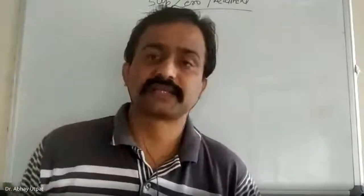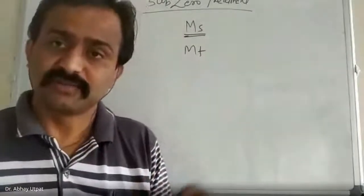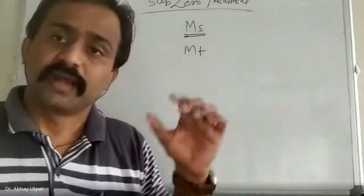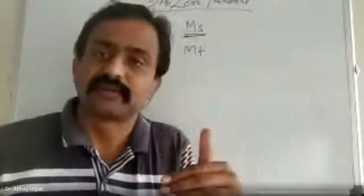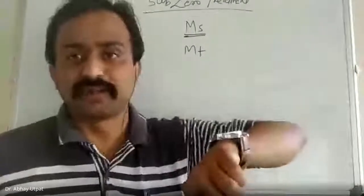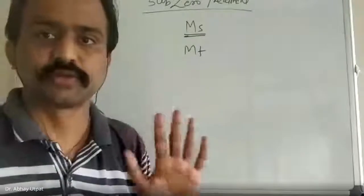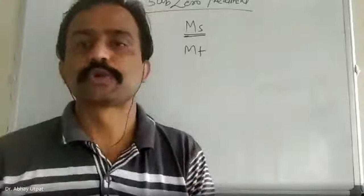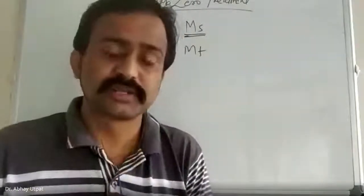And a question may be asked in the exam for 2-3 marks or 3 or 4 marks. For such components, usually alloy steels, the MF temperature is minus 10, minus 20, below 0 degree Celsius. That's why that hardening treatment is called sub-zero treatment. Very simple. I hope you understood. Sub-zero treatment is nothing but quenching below 0 degree Celsius. Simple, first sentence. Why quench below 0 degree Celsius?